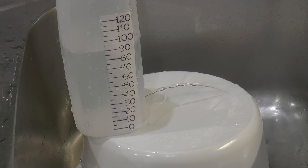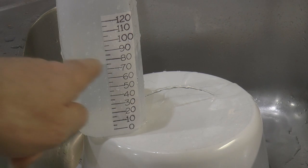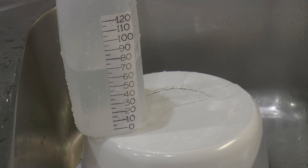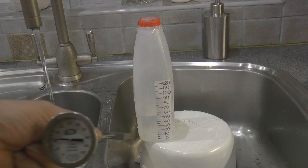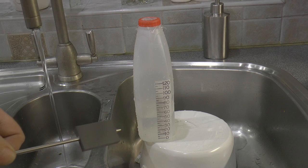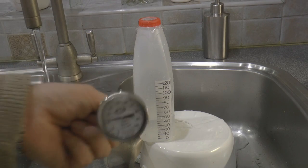That's not a calorimeter, that's an unknown quantity. It's always the same because that flow will be directly proportional to the temperature difference above ambient. And as you can see, as the water level drops down, so the leakage decreases. Another serious unknown. And what you're looking at there is basically the equivalent of what I'm holding in my hand. A temperature gauge, a block that has got an unknown absorption capability and it's got no protection around it, so it leaks heat away as you put it in. That's an exact simulation of what this device is.